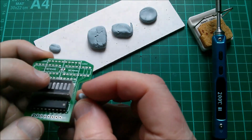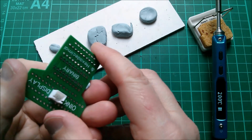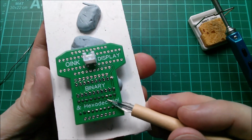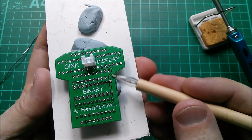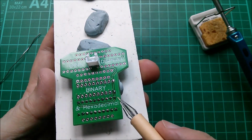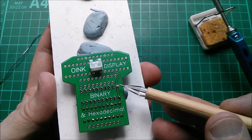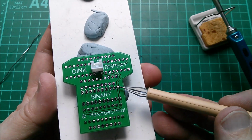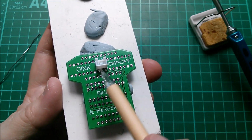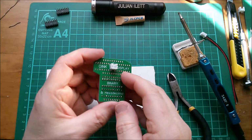Right, let's get some bits of blue tack to hold that on the board. These pins are really long, so they're going to have to be cropped, but let's solder and crop those. You can see that one of these LEDs I've just run VCC right through the cathode and the anode of the LED, and that is actually on my schematic as well. The only reason I did that was because I didn't want to route that VCC out beyond the package because there wasn't quite enough room, and since I'm not using that end LED, I actually put in the schematic that it's got its cathode and its anode connected together, both going to VCC, but it was much more of a routing layout issue than anything to do with the circuit. Looks like the sun's coming out.